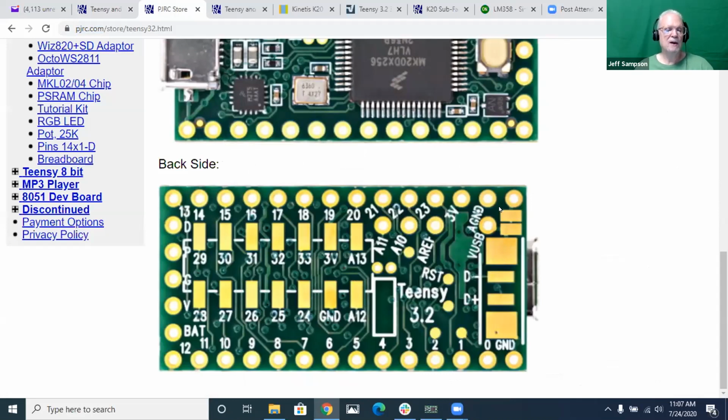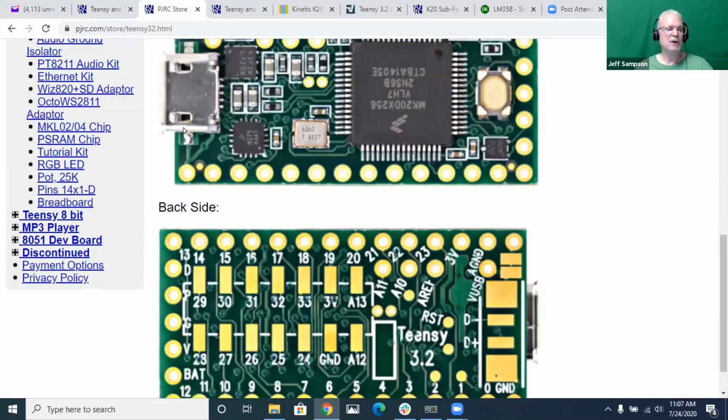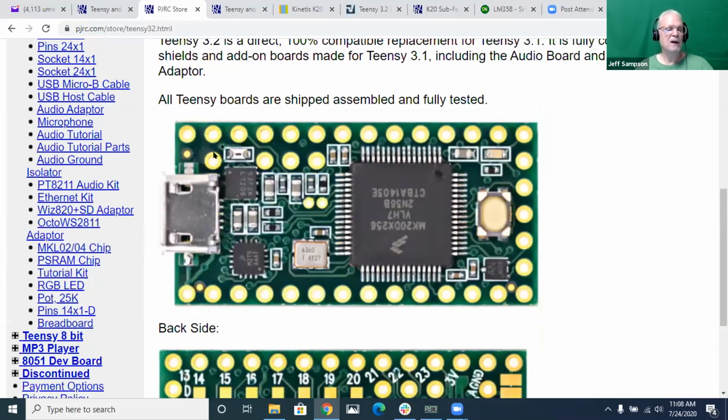Otherwise, it's this pad right here and this pad right here. If you just put a diode between those two, or if you've got the thing plugged into a board or something, then on the back where your connectors are, you could solder a wire from there and then run it to either, you can solder the diode in here and then have a piece of wire and then plug it in the back of your board or whatever. But that's just various mechanical ways to get around that.